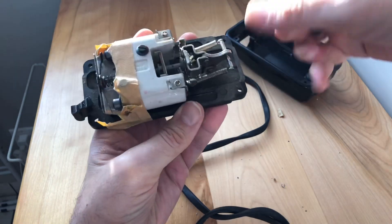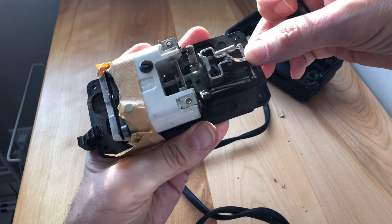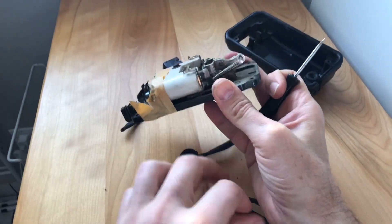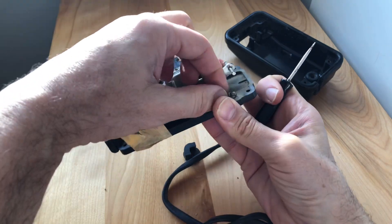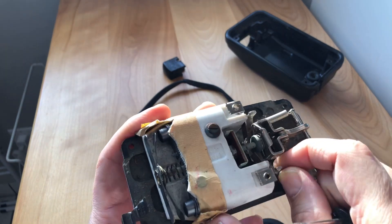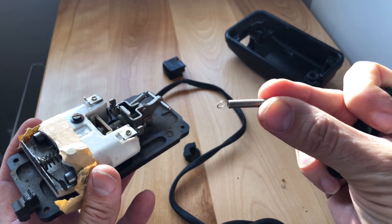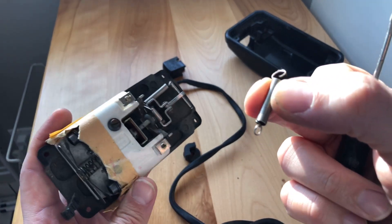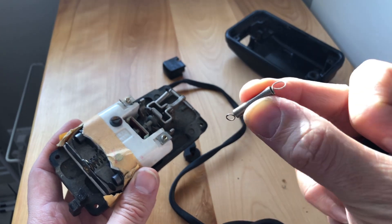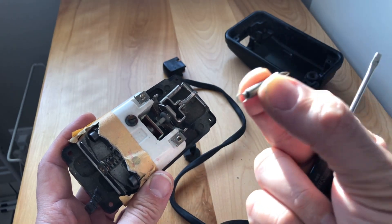What about these springs? This is an old controller — late 1940s, maybe 1950, about 70 years old — and look at these springs, they're in great shape. This pedal is not long for this world, but the springs are fine, so why not save them? I'm just going to take the spring off here. Springs can be a valuable part, particularly for zigzag sewing machines from the 50s and 60s — springs on those can break off or come loose.